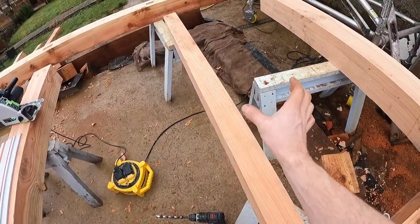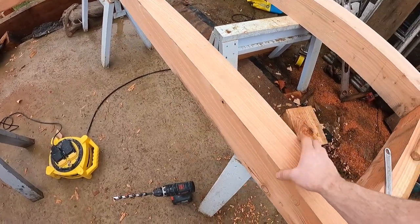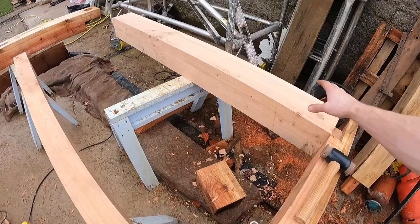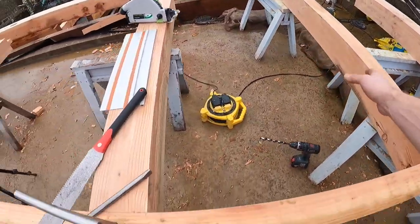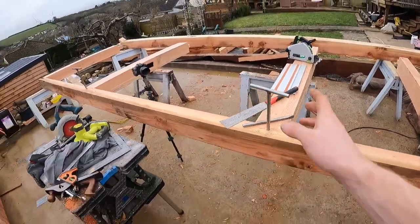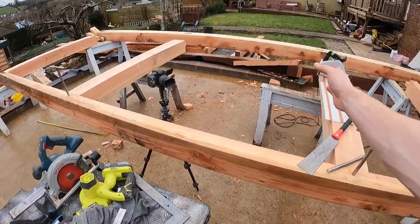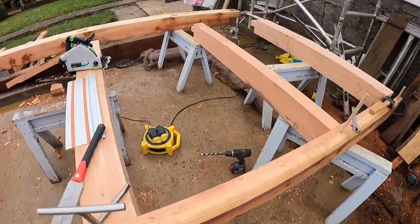Now, if you were doing this build sensibly, you'd probably use more like this sort of size timber down the middle. So you could still do square posts on the sides, on the corners, sorry, probably 6x6, and then you'd have kind of 4-inch studs, and you either put 3 down the side, or you could probably, as this is a 6-meter building, a lot of times when you see a garage here and 3-meter bays, so you just have one post in the middle, you cut down your workload by doing that.